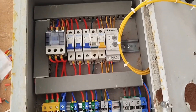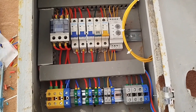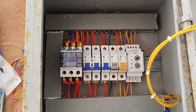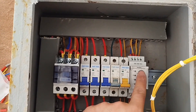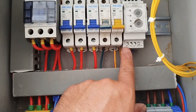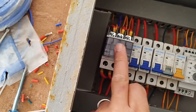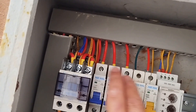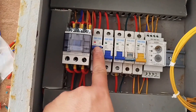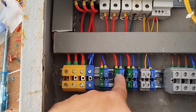The wiring of this electrical panel is complete. Now I will explain once more how this electrical panel operates. First, the three-phase power is connected from the main input terminals to the input of the contactor. Using the three-phase wires connected to the phase control relay, if the voltage is appropriate, the section from 15 to 18 is connected. And if the switch on the door of the electrical panel is activated, the contactor is activated and the three-phase power is connected to the input of the miniature switches. These miniature switches protect our circuit against short circuits, and if they are activated, the power is connected to the output terminals, and we can connect them to the consumers.